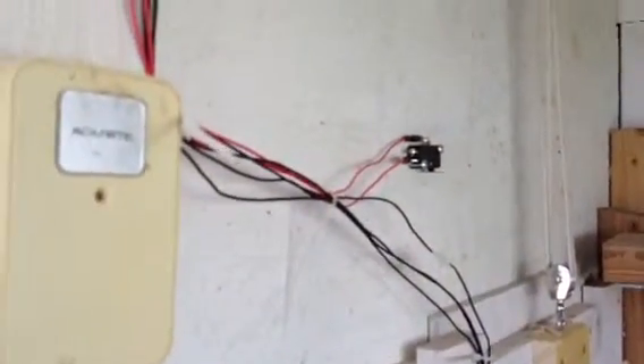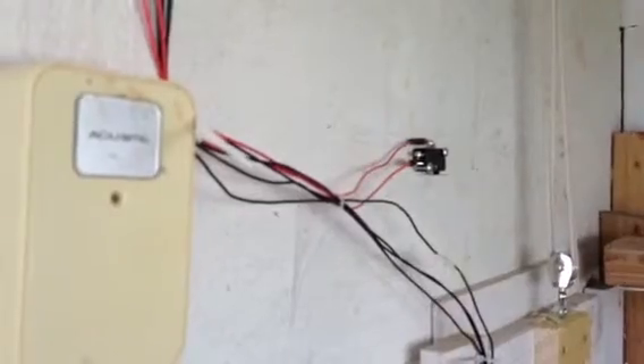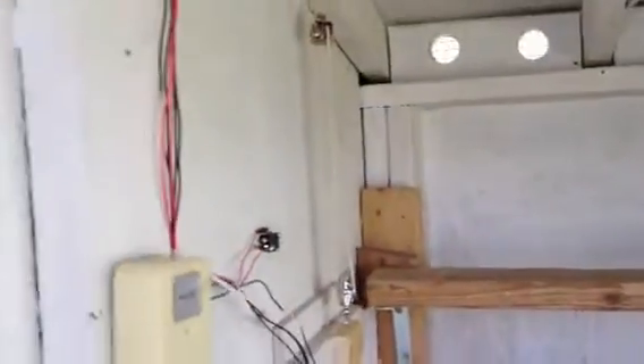And that's the motor starting up. It's hooked up to this, so it's winding up very slowly. The door is lifting, and what will happen is it will connect with that reed switch there, and it will stop the power to the motor. If something happens for some reason — either up or down — if the reed switches don't connect and it winds around, rather than burn up the engine it has this switch which kills power to the relay.